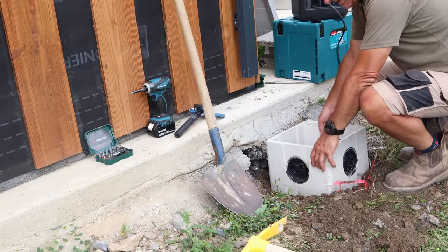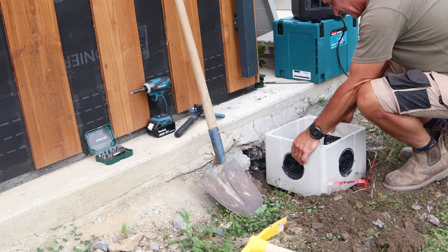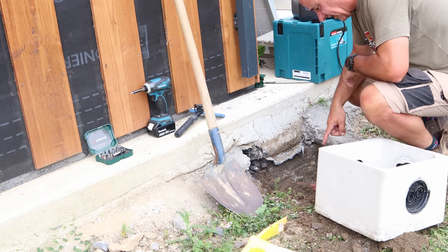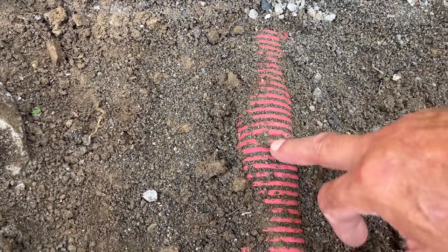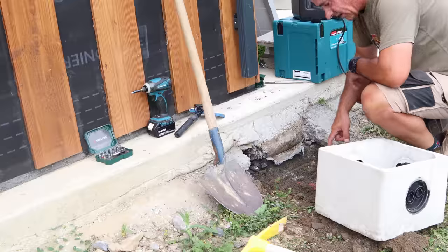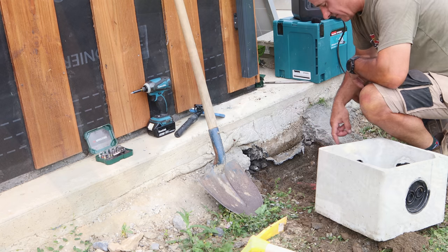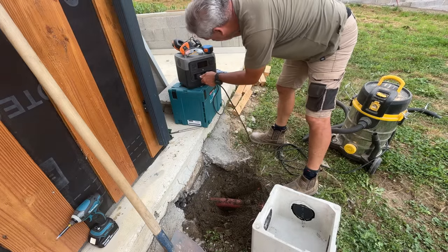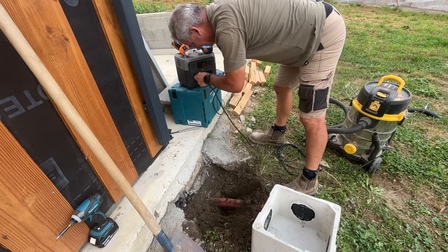Well, I've actually gone a bit low here. This is going to sit about here, so that's okay, because I can put a concrete pad down. And if you look under here, you can actually see the electrical conduit, so it's not too far down. I nearly put the pick through it, so I can use that hole there for my spur off to go and feed the pump. I wouldn't normally hoover out a hole, but I just want to get as much dirt as possible off this conduit, so when I basically break into it,